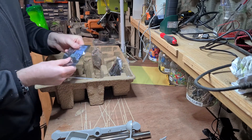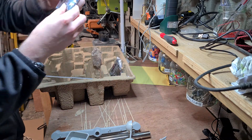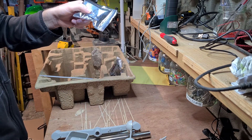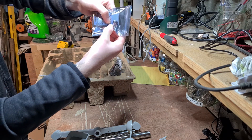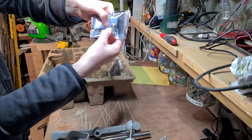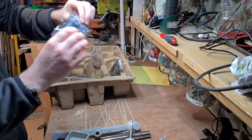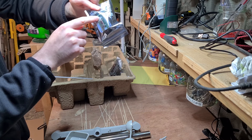Then you get the brains of it — this is the EnviroWeather unit. It's ridiculously small. This is the EnviroWeather; that's the jack for the leads for the various weather sensors. This tiny little square is the actual sensor that does the pressure, the temperature, the humidity. And then the other one is the light sensor over there. It has the Raspberry Pi Zero on the back, which is wireless — that big fat chip there is the wireless chip.